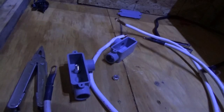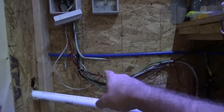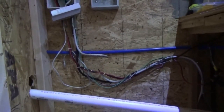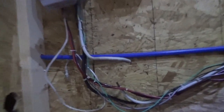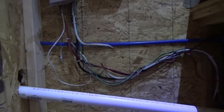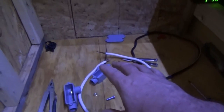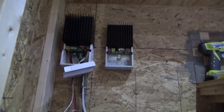I've got to get that going — right now I have no power coming into the house. I've cut the positive wire and removed all power from the original charge controller. This has been quite a long job; it's actually going to take me the entire day, which I did not expect. But I want to do it right, so I decided to use crimp-on end connectors and do everything proper and right. It just takes longer — but it'll be worth it in the end. I've got to figure out where these conduits will be mounted on the wall and which direction works best for my wiring. Once I get that sorted, I can start crimping on the ends and I'll have power coming in from the solar again.